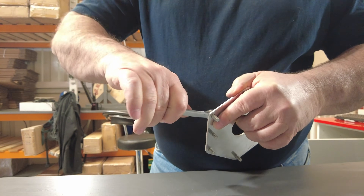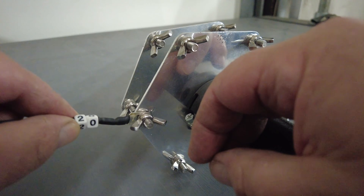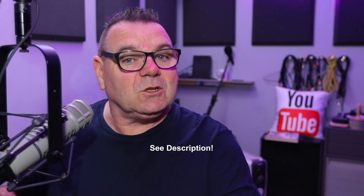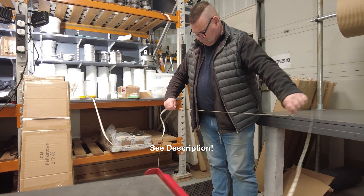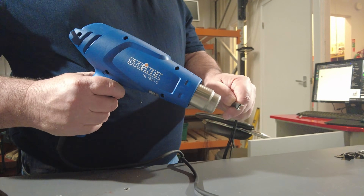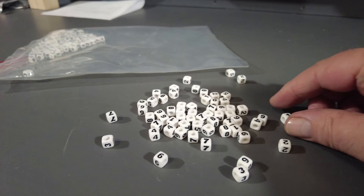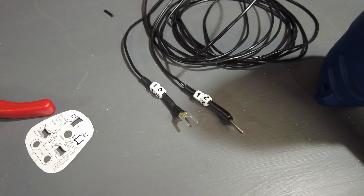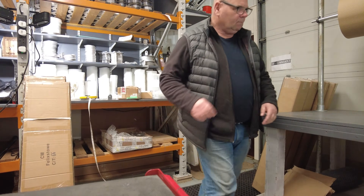Use a 10mm spanner to tighten them up without stripping the threads — that's a set-and-forget, you'll never need to play with that again. Then put a washer over the top and spin a wing nut down for your fork connectors. Put your radials and elements in there. I thoroughly recommend you make your elements first. Cut them a little too long, put your fork connector on, put your glue-lined heat shrink on — I use some cube markers I found for kids' bracelets. Once the fork connector is in place, measure halfway down the fork connector to the very end, then you can cut it exactly, because if you make a mistake stripping the wire you're just cutting into the spare you made for yourself.